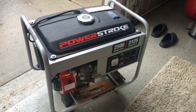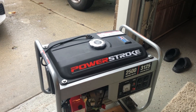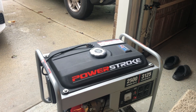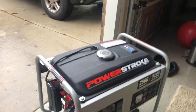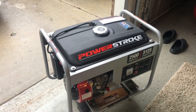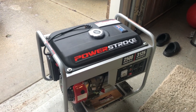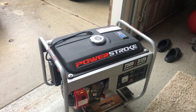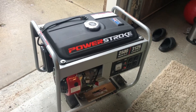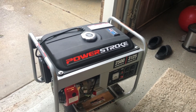This is a pretty standard unit — not too expensive, I think I paid a couple hundred bucks for it. It's got 2,500 running watts and 3,125 starting watts, which is pretty good. That's going to run your average refrigerator, your average freezer, or any average household appliance alone. You wouldn't want to stack up a garage freezer and a refrigerator all at once, because if they cut on at the same time that could overload this generator and do damage to both the generator and your appliance.